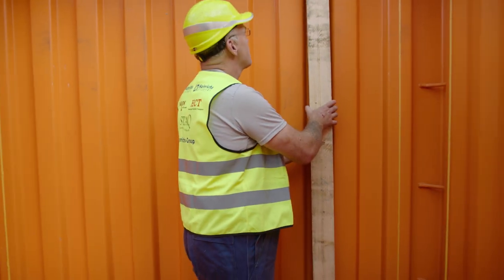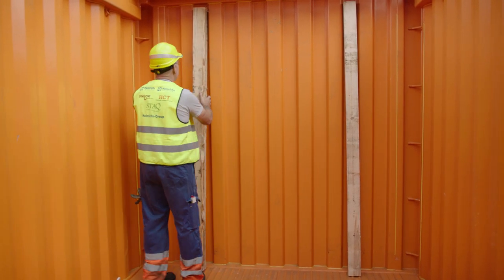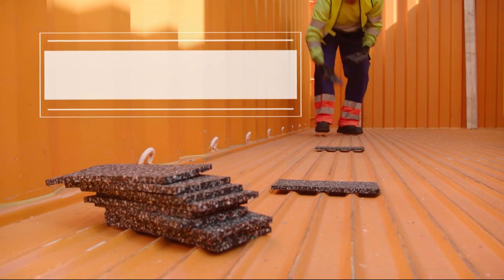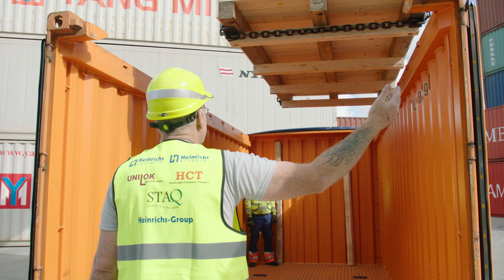In our example, as a case is intended to be loaded, insert the first blocking towards the forward end. You can also add the blocking after loading the cargo if it is more suitable. The Hapag-Lloyd steel floor allows you to load 7.6 tons per running meter in a 20-foot and 6 tons per running meter in a 40-foot.